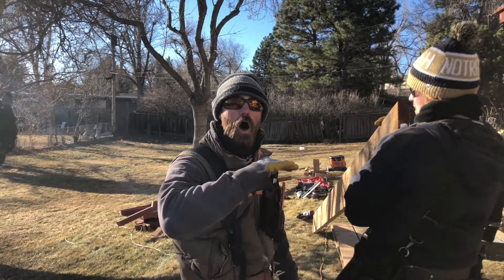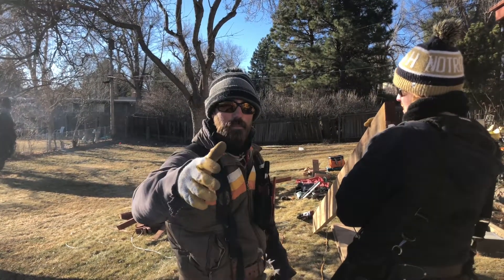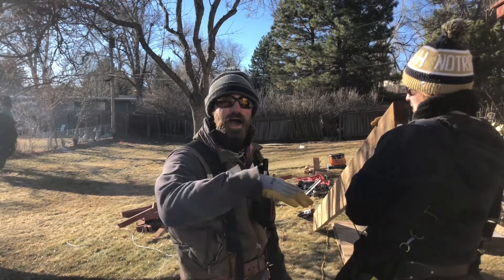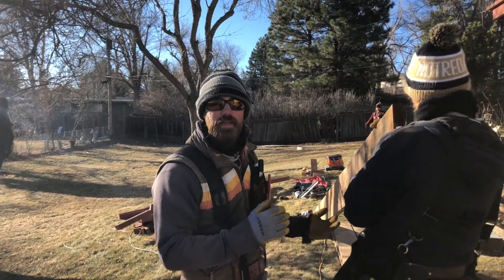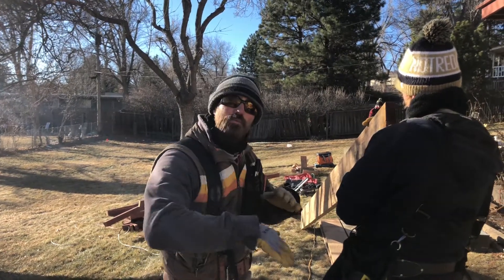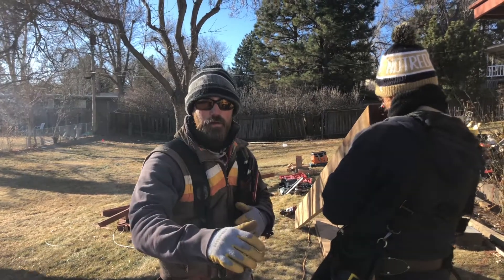It's very important to make sure you crown all of your joists up. If you put the crowns up, then you're good to go. If you put them down low, you're gonna have big dips and dives in it. Even though we go through and we plane it — check out our other video on planing the joists — but if you have them the wrong way, it's extremely hard to get that out compared to planing it down.